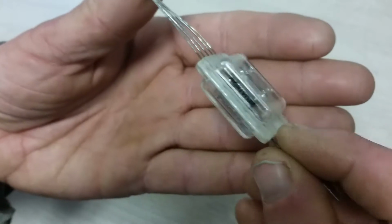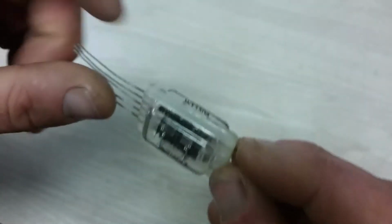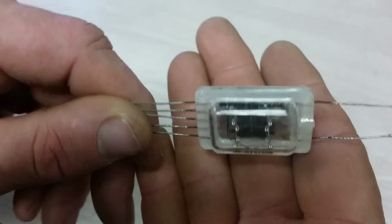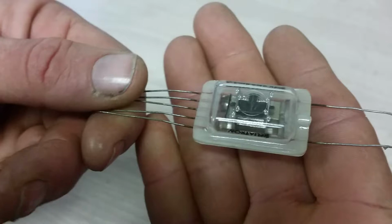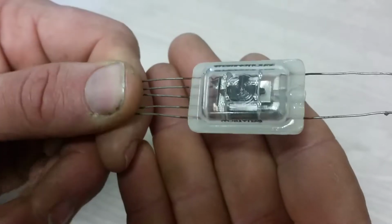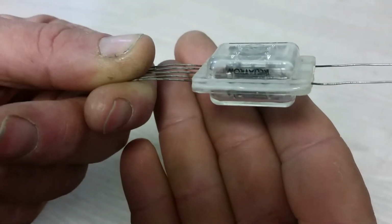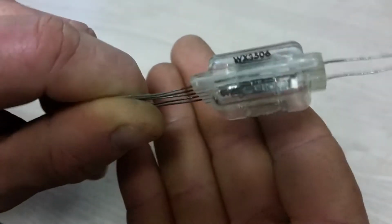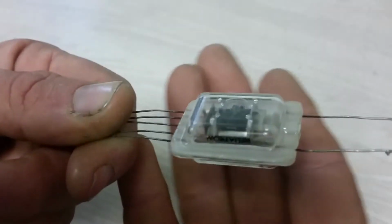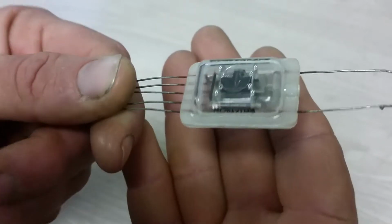And you stick it in between the 2 plates of glass and seal it. And from the looks of it, from this somewhat trained eye, it sort of looks like they tried to use sort of a frit seal. Now, frit is basically powdered glass, very finely powdered glass. And it looks to me like they put a layer of the powdered glass in between the 2 sandwich pieces here of the main glass, obviously sticking the tube inside as well, and then pressed it with heat to melt the frit and seal everything up.